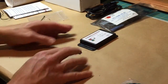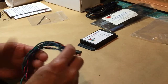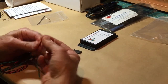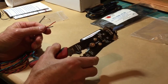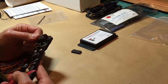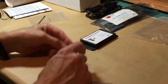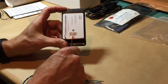Now let's prepare the wires for the connector. You'll start by straightening the ends of each wire, which makes it easier both to strip and to insert them into the wire connector. You'll be stripping off a quarter inch of insulation on each end. A quarter inch of exposed bare wire is really good — you'll insert it fully into the connector and a little bit of the insulation will also be recessed, which protects the wires from shorting or having exposed wiring after some use.